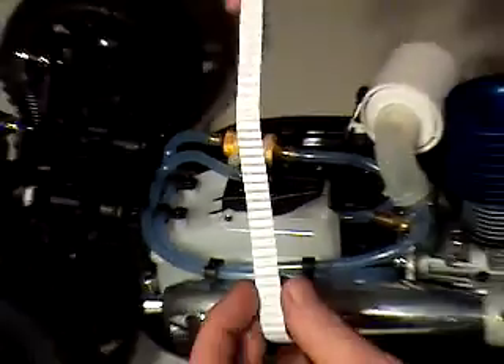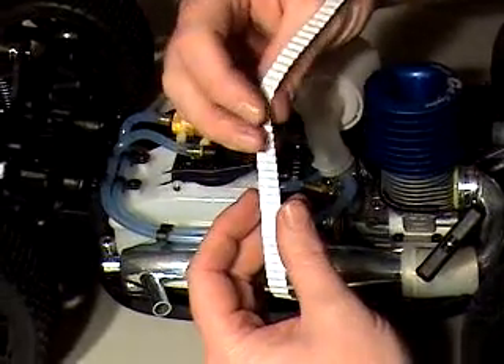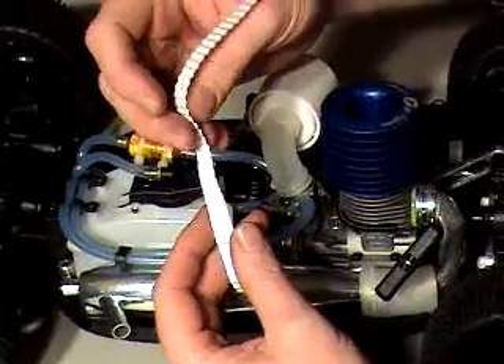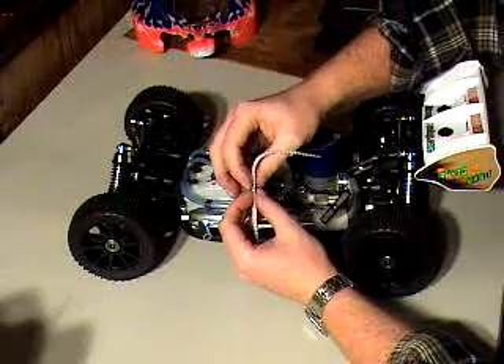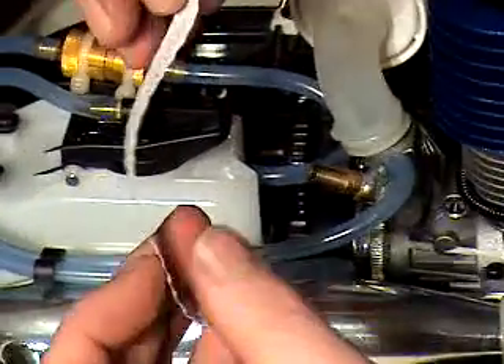You can actually see it. This is just about right — that's how it should look. If it were too tight, the paper might be torn in places. There would be big black marks on it from the grease, and it would be torn, or there would be holes in it — that means it's too tight and you're going to have to loosen it. If it was too loose, then there would be hardly any crinkle and this paper would be more flat — just a few marks, but not much accordion.